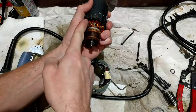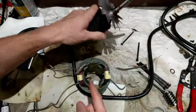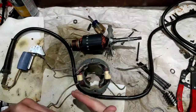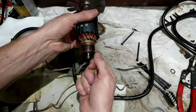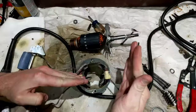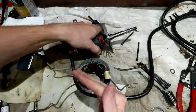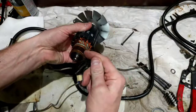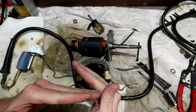The electricity going into one of these contacts is ending up roughly 30 degrees offset — it's going to create a misalignment. So our magnetic field in one coil is going this way, our magnetic field in the other coil is going that way, and so our push is always going to be consistently in one direction. As this thing turns, the carbon brush slides over the contacts, and every time we hit a new contact, instead of our field drifting with the motor, it's jumping from contact to contact. So it maintains approximately, within some number of degrees, the same angular field difference.